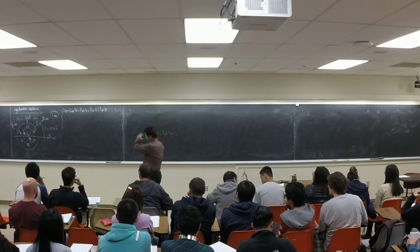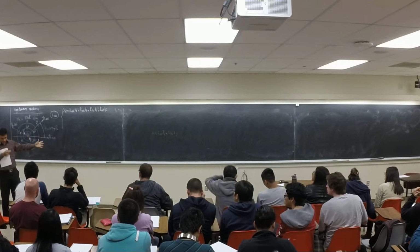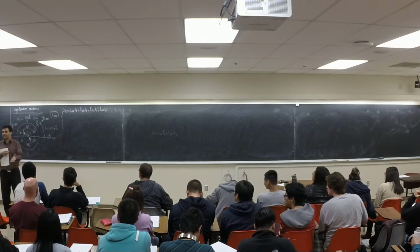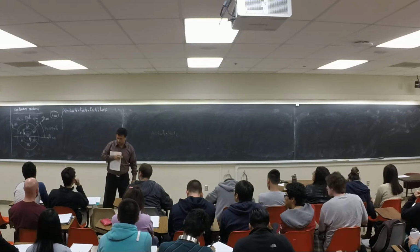So basically, I'm going to write all the flux equations and simplify them as much as I can. After that, if I take a derivative of that, it's going to give me the back EMF for the machine. And when I simplify that, at the end, I can draw the equivalent circuit of the machine, right?